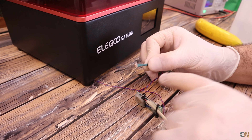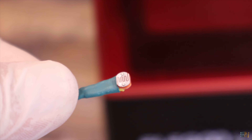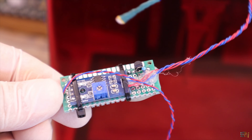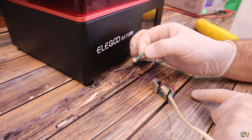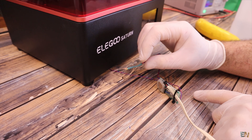For that I've made this very small module with an LDR — a light dependent resistor — whose resistance changes depending on the light, including UV light. We connect that to this module which is just an amplifier, and each time we detect UV light we activate the output. You connect that output to a transistor, and that transistor acts like a switch between the wires of your camera. Each time light is detected, it activates the shutter. All we have to do is place this small LDR sensor inside the printer through a hole at the back, in front of the UV LEDs.